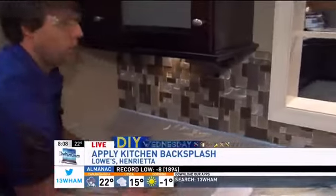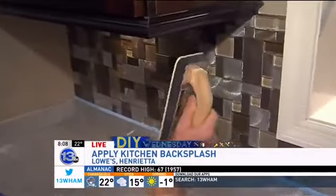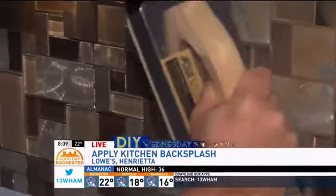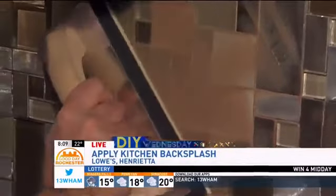Kind of like what we did with the wall, before you apply the grout. Okay. So for starters, and I'll let you do this in a sec, we have to apply it and kind of press it in on a 45-degree angle. So it doesn't get too goopy in there? Well, you want to get it right in the angle. Sometimes when you go against it, it doesn't fill both sides, but the 45-degree does. So basically just a press.